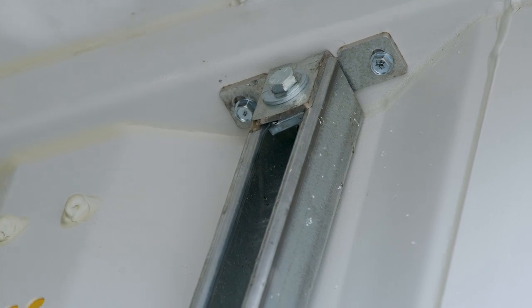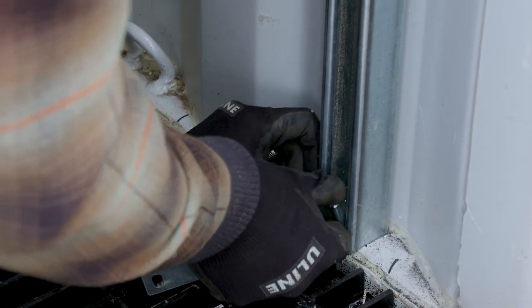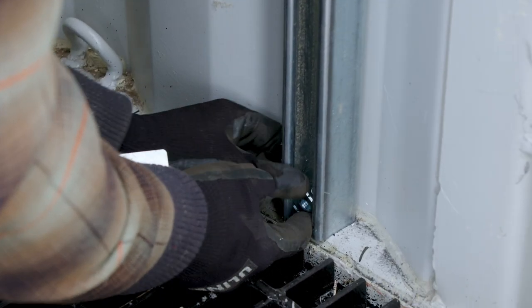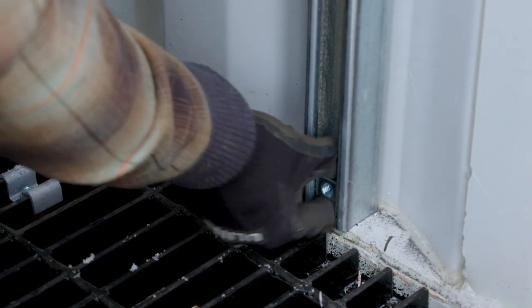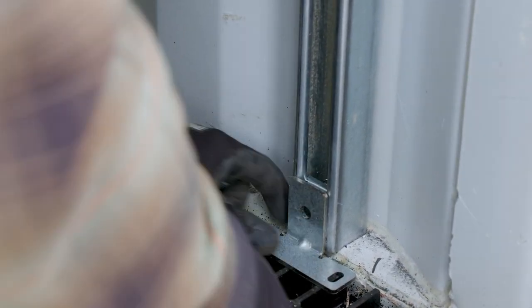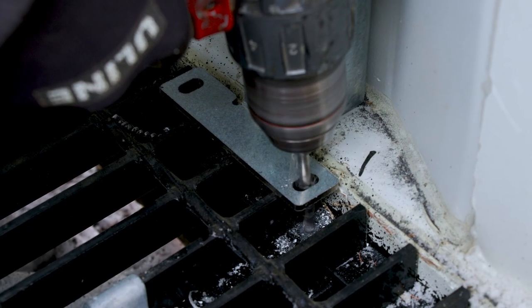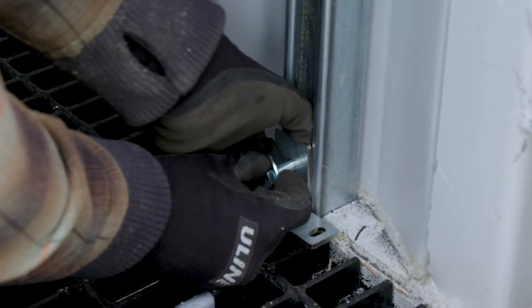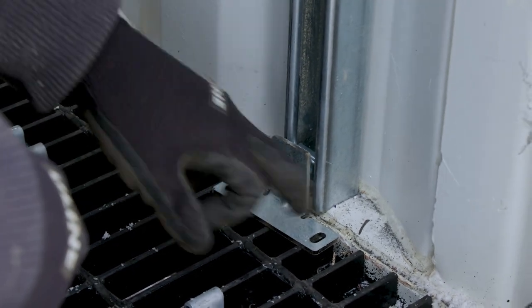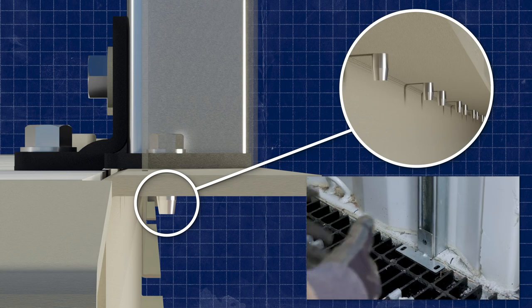That's on there pretty good. We haven't done the bottom yet, so once we do that, this thing will be tight in this container. This could have even been done prior to holding this thing up. We're going to aim for a spring nut and see if we can utilize that and self-tap down through this flat bar to hold this strut in place without using the CSM brackets. A downfall to the CSM brackets is that the quarter-inch thread cutters on the side go through that bottom channel, and if you look from the outside, you can see the bolts — they penetrate the envelope of the container.